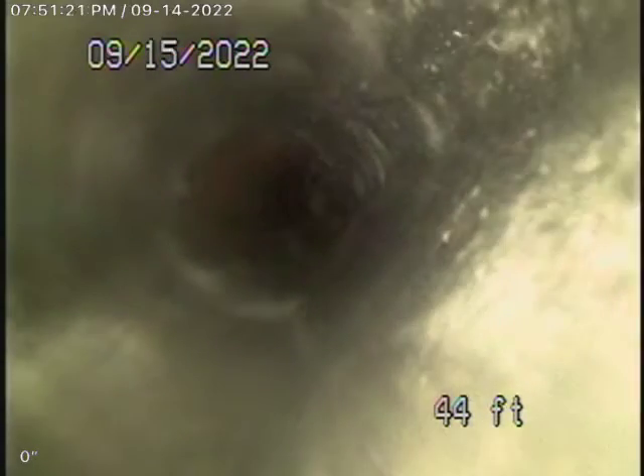So that's the new liner there that's patched. We don't hear no more water draining out from that side. You guys could do your checks tomorrow, run everything, have one of you guys get down here in the crawl space to make sure. But we are recommending do something with this other line back here before it fails. Basically, I just want to show you that water coming through here is draining through our liner — that's what we wanted. So I'll send you this after video, and you guys do have a before video. Discount Drain Cleaning — we use a light-ray UV patch to patch this hole in this pipe. We'll send you this video.